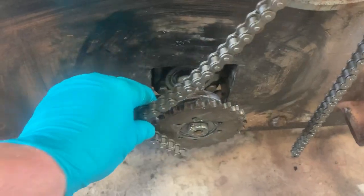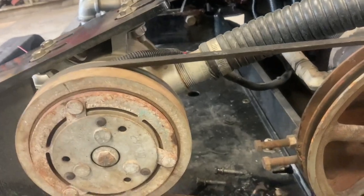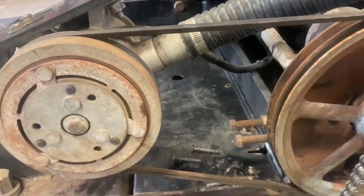If it hasn't been apart for a number of years — or even one year when it's new, I don't think they put any anti-seize on there — it can sometimes get tough to do. You might want to just order the parts because you might end up cutting them apart with a cutting torch. So we've just got to reinstall the chain, probably put a new water pump belt on it as well, just for preventative maintenance.